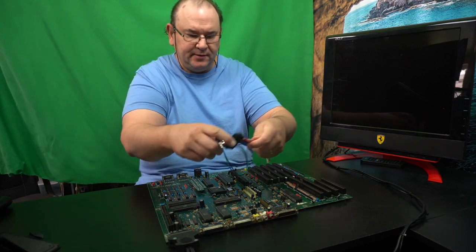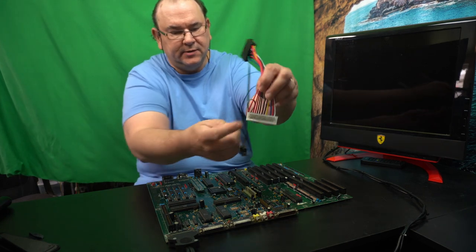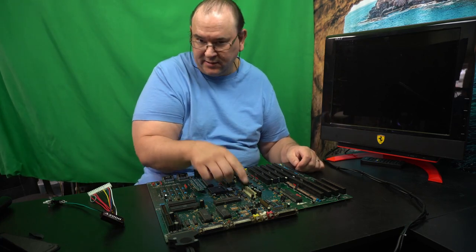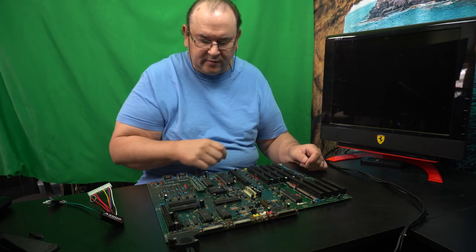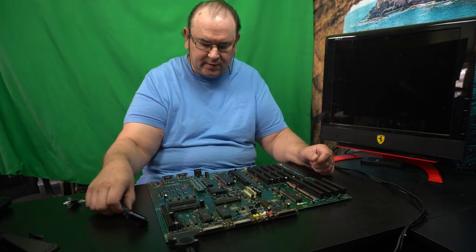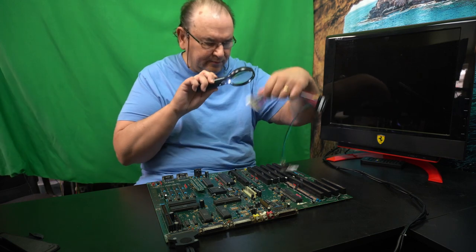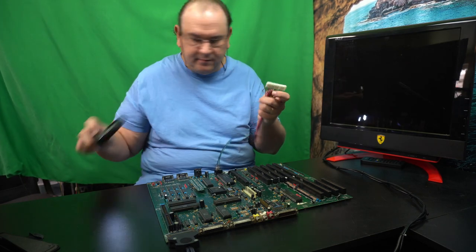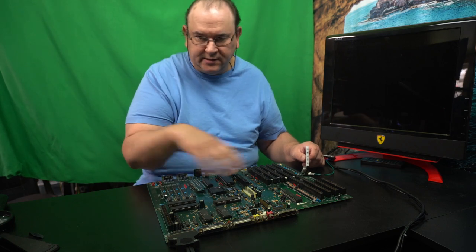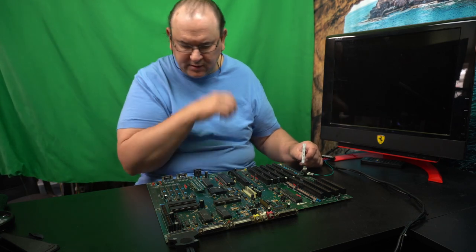Sort of, you know, proper switch, ATX connector, and then the other. And then they've also added a nice comment here. You won't be able to read this text, but it's written here that when you have the original Amiga 2000 power supply, it creates what is called a tick signal that synchronizes certain activities when the system is running. So that doesn't exist if you have a PC power supply. But there is a jumper, what was it called again? J300. And that's actually here. So you need to short pin 2 and 3, and then it generates the tick signal from another source, from the board. I think it's the video signal, like the cross-scanning of the video signal or something.